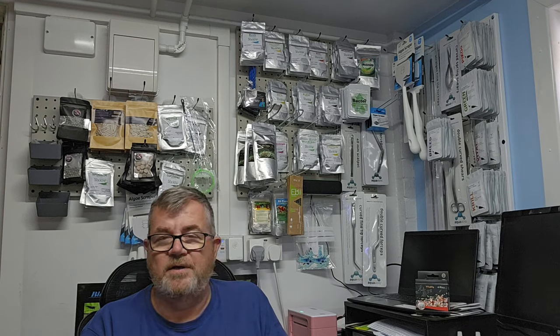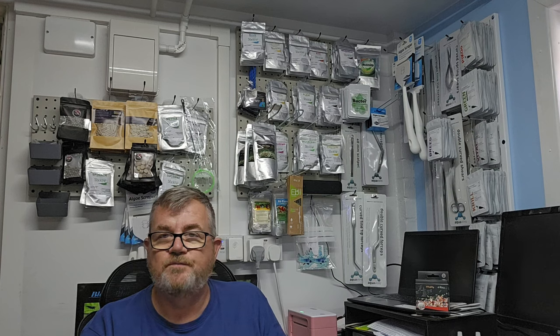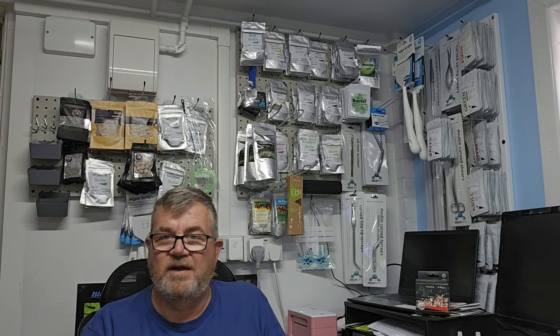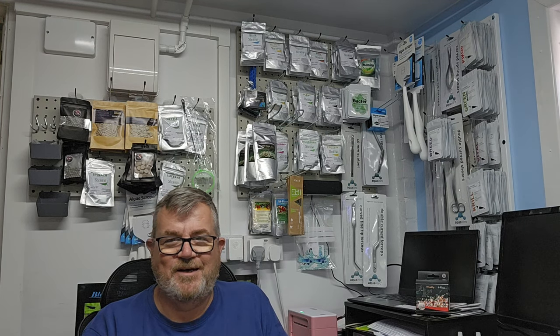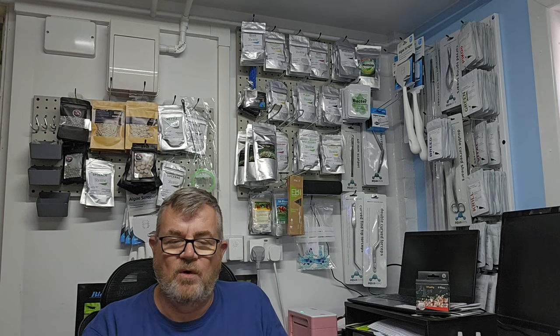There are a couple of products on the market — I'll go through those a bit later. My unit is outside in the front garden connected to a tap. I have ordered new filters and I'm going to change the pre-sediment, carbon block, and deionising resin chambers and I'll get that on film for you. I've got massive OCD — I need to wash out the container and clean everything as well.